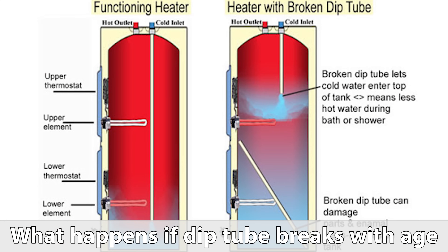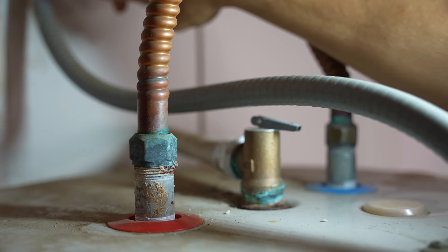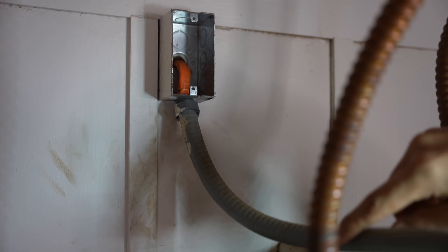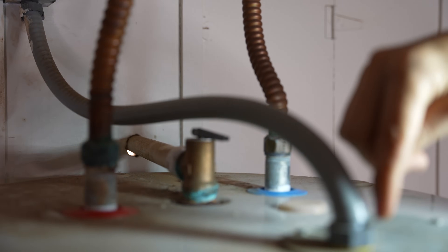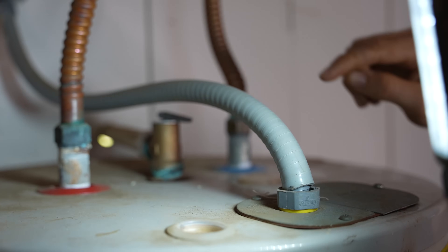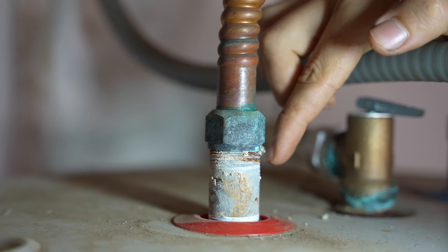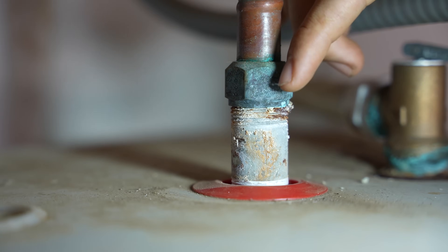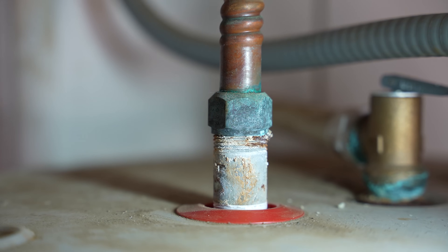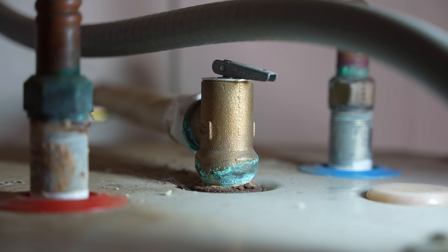That way, while you're taking a shower, the new water coming in does not go directly into the hot, causing you to have a lukewarm shower. And this flexible conduit coming out from the wall — you can see that orange wire — that's 240 volts that come into the water heater through this little electric whip. They go right up on top and then to the thermostats and the electrical elements inside the water heater. If you look at the fittings, they're all corroded and there's rust here too. Maybe it was leaking at one point, or there's no rubber gasket, so the dissimilar metals are starting to corrode each other.